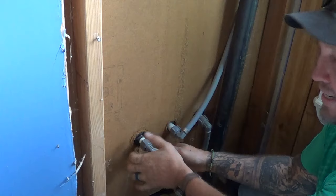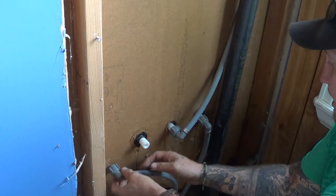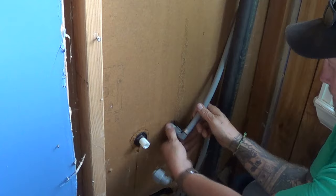We can see here are the fittings we're looking for — this is the back side of the faucet. These are swivel fittings most of the time, so this is just going to turn off. A lot of times they're just hand tight, so I want to be real careful turning these off. We're just going to take all of these off. This is the one for the cold side, and this is the one going up to the shower arm.